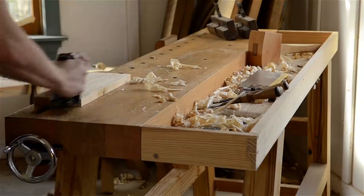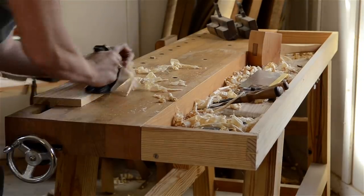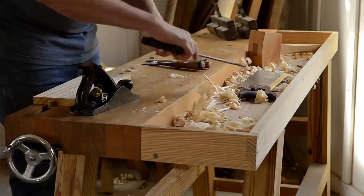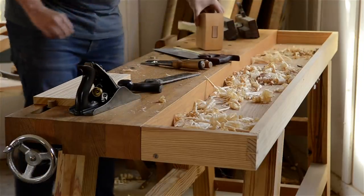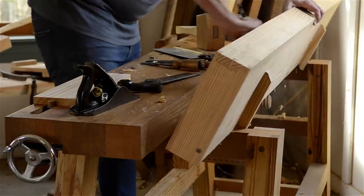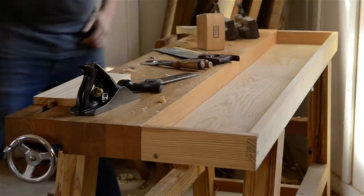The last major feature that I love about these workbenches is the removable tray. Some woodworkers say they don't like trays because they're hard to clean, but this really isn't a problem with a Moravian workbench — you simply lift the tray out and dump the shavings on the ground. By building a simple spacer to go in the tool tray, you can have a wider work surface for assembly or glue-ups. But 95 to 99% of the time, the 13-inch wide workbench top surface is more than enough.